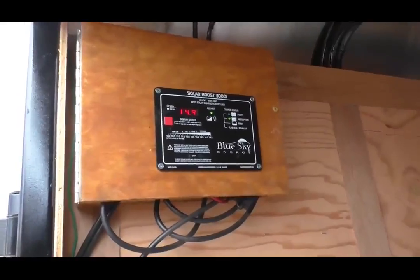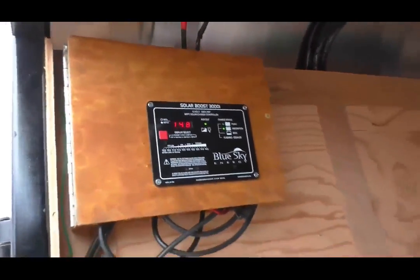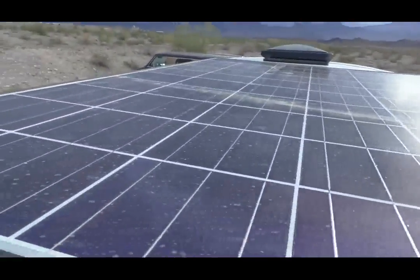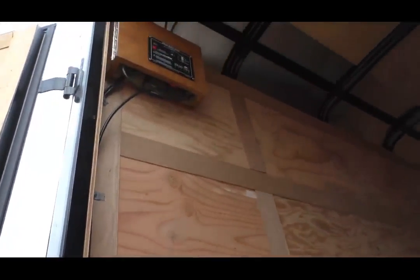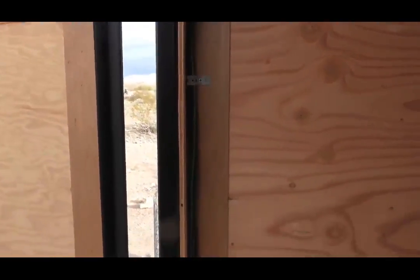Not all controllers let you calibrate like this, but the MPPT Blue Sky does. Right now it's pulling in 0.8 amps even on a cloudy day — 270 watt Kyocera, big old panel. We're going to put the bed back and put a couple pieces of wood to hold the battery in place. Everything's fused. Hopefully this helped you learn how to put solar in your own rig. If you found this video valuable, please like it, share it with a friend who needs solar, and thanks for watching.